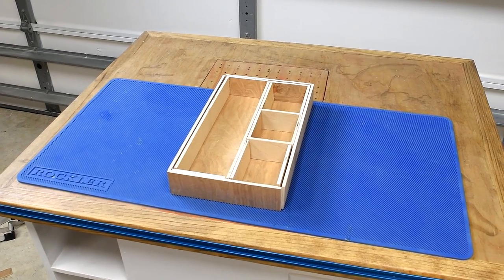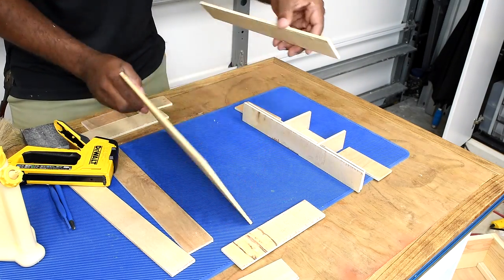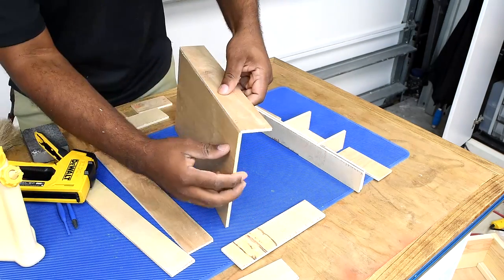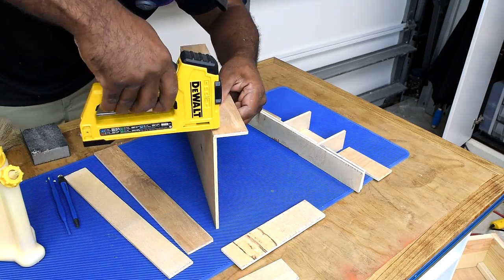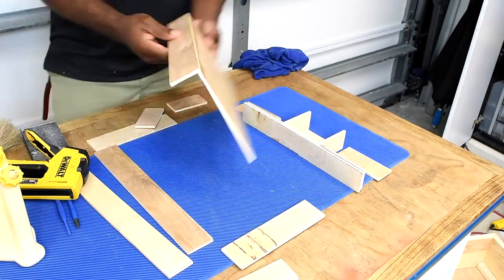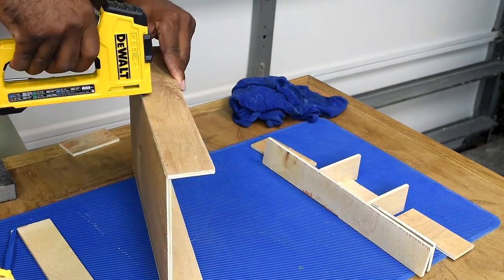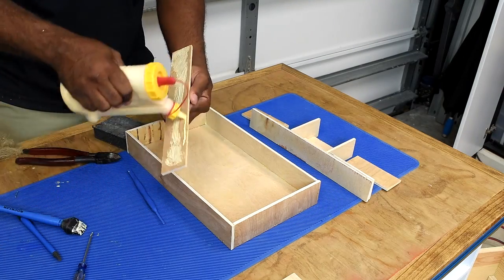On to making the organization box — lots of parts but super simple. I'm using all quarter-inch plywood. The outer perimeter pieces are all a quarter inch taller than the interior ones. The entire box could be glued, but gluing and waiting takes too long, so I'm using a hand staple gun to speed things up. All outer pieces are butted against each other along the perimeter with wood glue applied, and all interior pieces will only be glued.